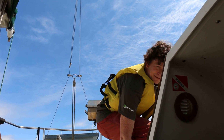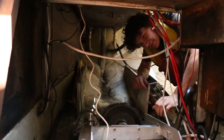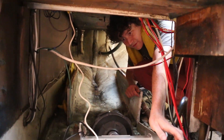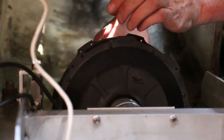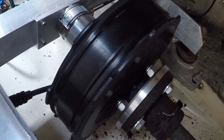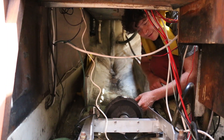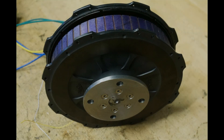Down here, the original mounts for the Yanmar engine are pretty overkill for what we have — in the end just a little aluminum frame structure. The motor is directly coupled to the propeller shaft, and I just used the disc mounting flange of the standard disc side cover to make an adapter plate to the four bolts for the propeller coupling.